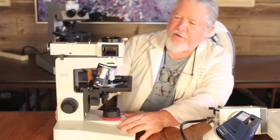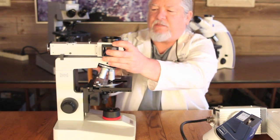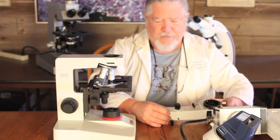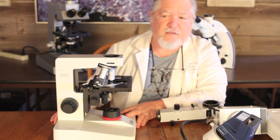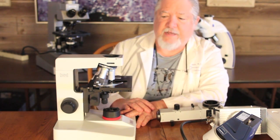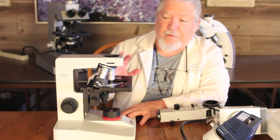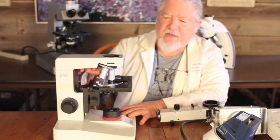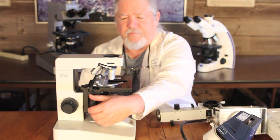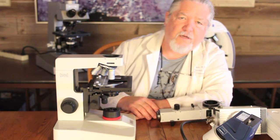Now we have the vertical illuminator on top of the microscope, and we're going to gently take this off also. There's a loosening screw, and the illuminator just comes away completely. Now we have pretty much deconstructed the microscope. We could take off the objectives and take out the condenser. If you are going to ship your microscope around the country, package it very well. I would recommend you take off the objectives, put them in separate objective cases, take off your condenser, and package that separately, because these are quality optical systems and you don't want to hurt them in any way.